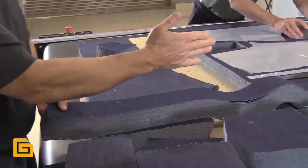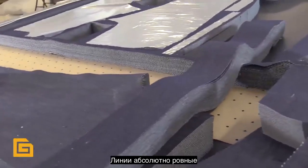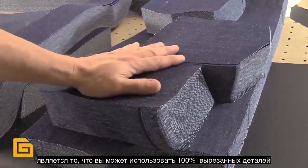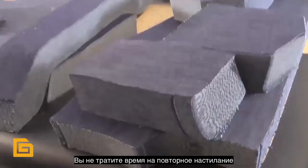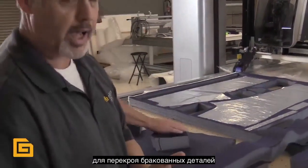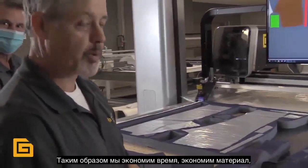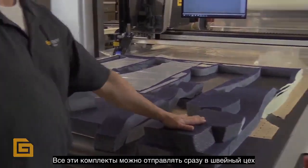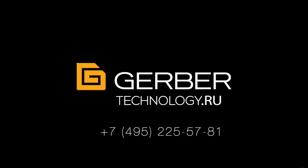We're not weaving through, which means the knife isn't deflecting to get through the cut — just a really nice cut. Part of the return on investment on this machine is that we can use 100% of the parts that we cut. We're not having to do recuts, not wasting time re-spreading for a recut, and we're not dealing with shading issues from a recut. We're saving material, we're saving time — and time and material is money. All of these bundles can go directly to the sewing room.